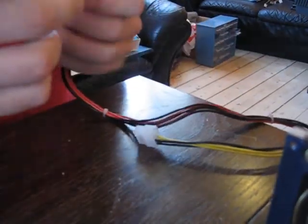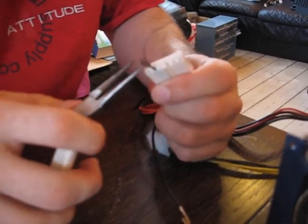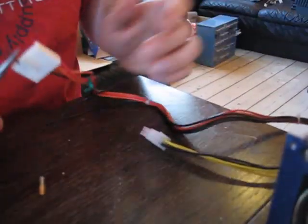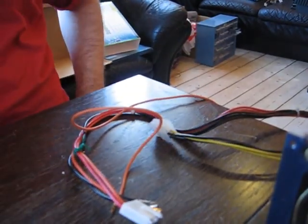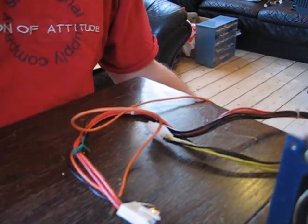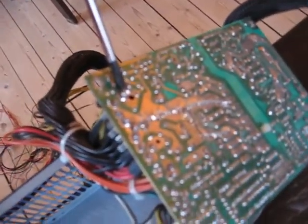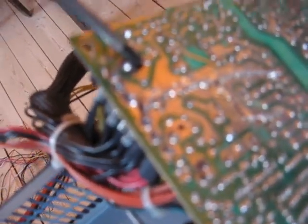I already have one black wire, but I need two blacks. The problem is I am going to need three yellow wires, and the power supply does not have that — except if I take some of the Molex power connectors, but I am not going to do that. But I have spotted here on the circuit board, right here, is the 12-volt rail. There is actually a hole here, so I intend to take three wires of the proper thickness, feed them through, and solder them on to get additional 12-volt power.